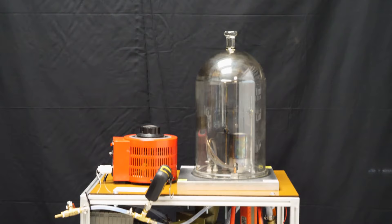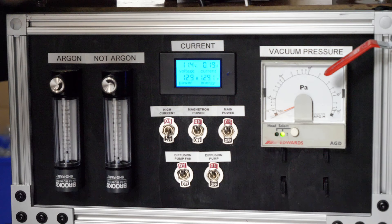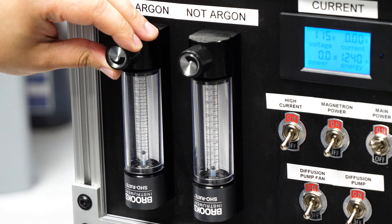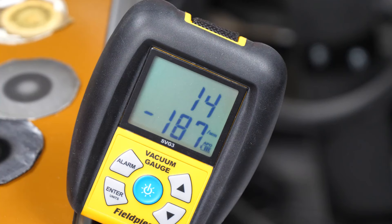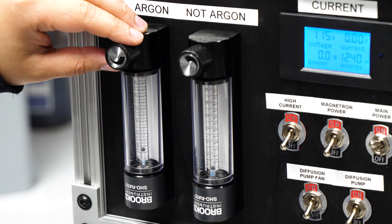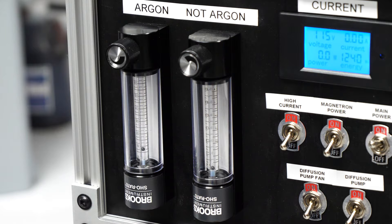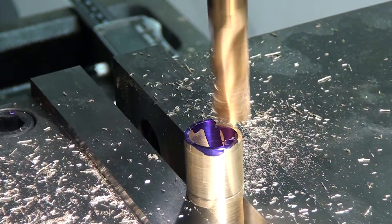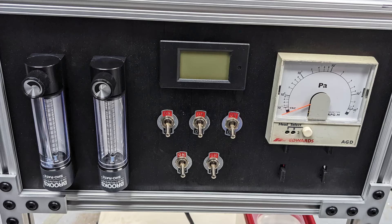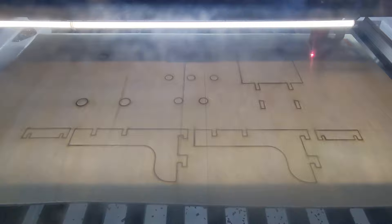There are a few notes about the control panel. Specifically, the gas flow controllers: these things are not accurate, which is a shame because they cost $200 a piece — sometimes they read no gas flow but the vacuum gauge clearly shows lots of gas flowing into the chamber. For use in a vacuum system, it's best to take the whole central cartridge out and flip it upside down so the valve is on the vacuum side. The manufacturer does not make this easy — we actually had to machine a custom tool like a hollowed-out flat-head screwdriver just to loosen the nuts that hold the thing together. The control panel itself was simply made out of laser-cut plywood painted black.